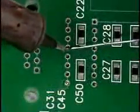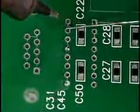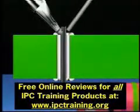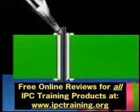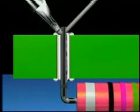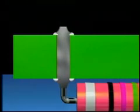The feed rate is how fast a given amount of solder is fed into the connection during the soldering operation. If the solder is fed too quickly, more of the tip's thermal energy will be used to melt the solder instead of heating the connection area. This results in improper flow and wetting. An ideal feed rate will allow the solder to be flowed into the connection continuously during the soldering operation. This will ensure flux is being supplied throughout the process.